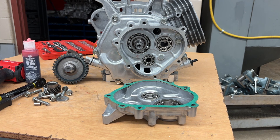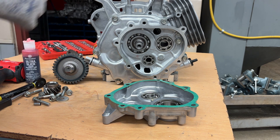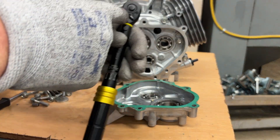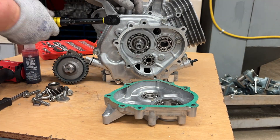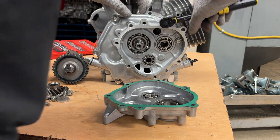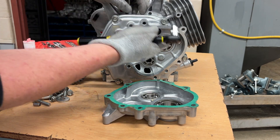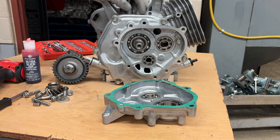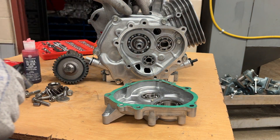We are into the next step. We double-checked — if you didn't do this yesterday, just double check: set your torque wrench to 194 and go around. Make sure that you count seven bolts — one, two, three, four, five, six, seven — and go around and check those torques on them all, just to make sure from the day before.